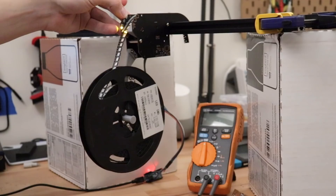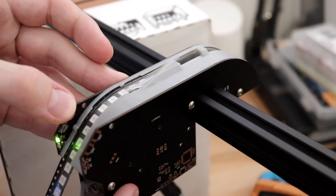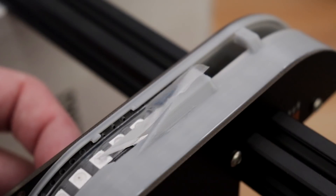I am a big ball of sad. I didn't change the basic drive system from the first version, but I made some changes to the way the film was hopefully going to peel off, and I just kind of figured it would work this time. As I say that out loud, it seems so naive. It doesn't work. When I try and drive the tape forward without worrying about the film at all, it's great — indexes tape beautifully, no problem. But every time I try and put the film over this X-Acto knife blade, which is supposed to slice one half of the film off the tape and guide it up so the pick can come and grab the part, it just jams. There isn't enough torque in the motor to push the tape into the blade and have the film peel up.